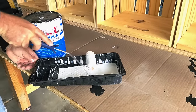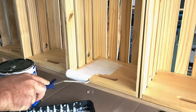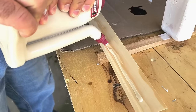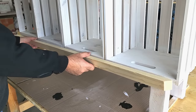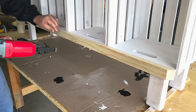Once we do that, we're going to get some primer and put it all over the wood crates. We need this because primer helps the paint stick and adhere to the wood — without it, you might get some flaking. I didn't like the bottom of how the wood crates looked, so I did a little trim piece of one by two pine and put it on there. I used some glue to make sure it stays in place.